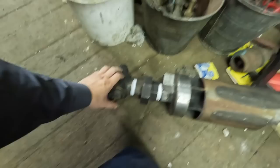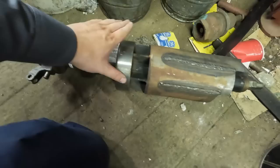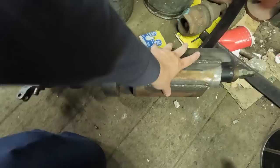In previous Railroads 101 videos, I've been drawing stuff out on the computer, but thankfully today I've got the actual bits in front of me, which is pretty cool. So here's my whistle, all put together, and you can see that it is a horizontal button valve style operated whistle, the valve separate. We ran out of 2-inch couplings, so there's a union there. That's a little hokey, but it is what it is. This is the bowl, the bottom here, and this is the bell, the top. Let's take a look at these individually.